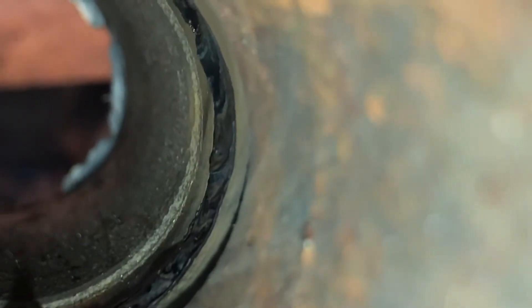So this is after I completed the root. You can see everything broke down really good. You can't see any beveled edges. This is about as close as I could get my camera. There's a little push-through all the way around it. I do have one little lump there on the bottom — I'm a little rusty, it's been a little while since I put a root in like this. But anyway, that's pretty much what you're looking for. You'd rather have push-through than suck back. You definitely don't want any suck back — that will bust you on the test. The little lump at the bottom was definitely less than an eighth of an inch. An eighth of an inch is normally the max you can have on the inside of the root.